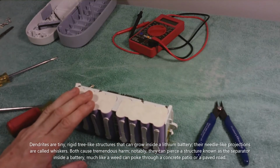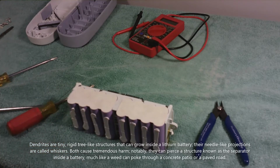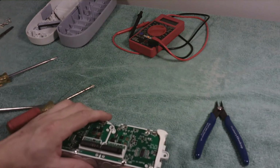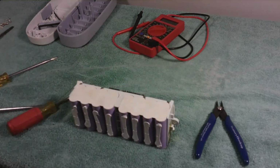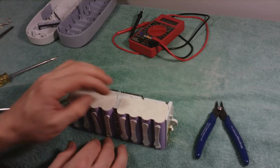And when those spikes form, they can short circuit the layers out, and they can cause issues. When that dendrite, that metal spike, forms, it can cause the battery to discharge on its own. So it can have a slow discharge, or a pretty fast discharge. Or if you charge and discharge it with that dendrite formed, it can cause extreme heat, and then we're back into that runaway, and they will catch fire again. So that is another reason that these can be extremely dangerous, and you want to be careful.